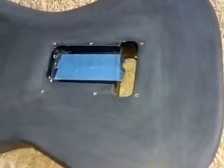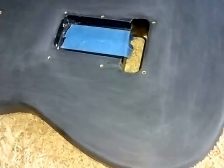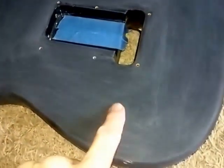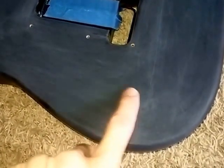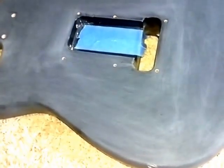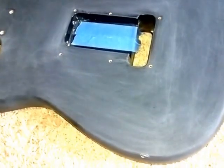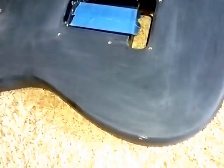You do want to prep everything very well. I wiped everything down with acetone before I even sand it, because if there's any kind of wax and you sand it, you'll force it into your scratches and it'll cause paint failure. So wipe down with acetone first, then scuff it, then do a little sanding — either wet or dry. I did this dry because I didn't want to get the wood wet.